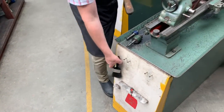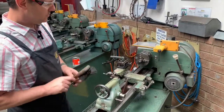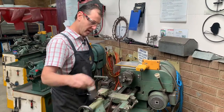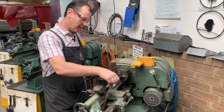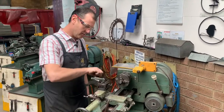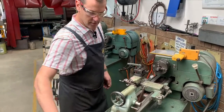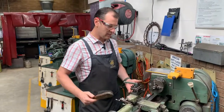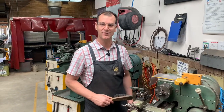That's pretty much a good overview. Down on the right-hand side we have a variety of different brushes — really important for housekeeping. Make sure we clean up after ourselves starting from the top of the chuck, around the chuck, around the bed, using the small brush around our cutter and tool post, then the large brush to clean up our tray and bed afterwards. Anyway, that's our Hercus lathe — a bit of an overview and introduction. Look forward to seeing you again in the next videos, thanks very much.